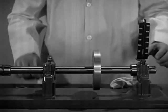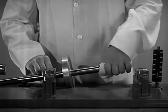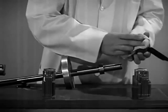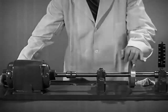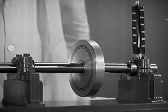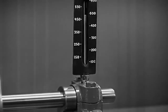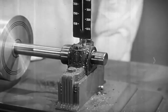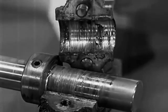A small flywheel bearing shows why it is necessary to use a good lubricant. We first remove all the grease or oil. When we spin the wheel, the metal surfaces rub against each other. Without oil, they grow hot. The soft bearing metal is melted. Friction binds the moving parts together, and soon the flywheel will stop. Now, without the protection of oil, both surfaces are ruined.